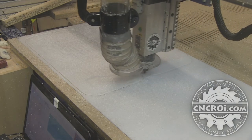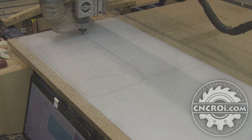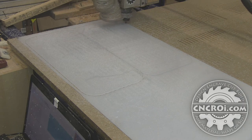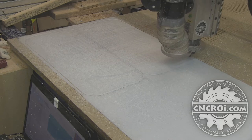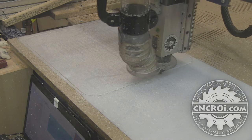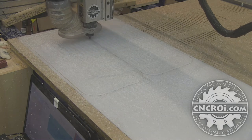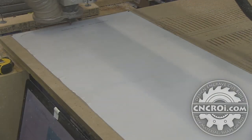With polycarbonate, the reason why this is a great material for industrial use is that it's literally bullet-proof glass. You might see a lot of this stuff in big CNC machines. Because if something goes flying off — if it's acrylic, it's just like a glass window, it'll fly right through it. With polycarbonate, it'll actually hold on and stop it from coming through, or it'll bring the whole window with it.